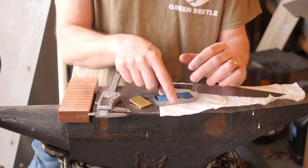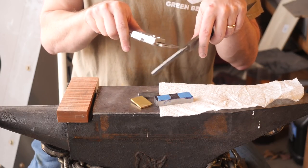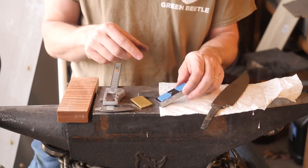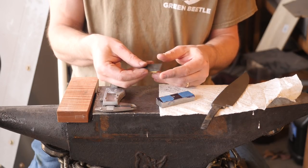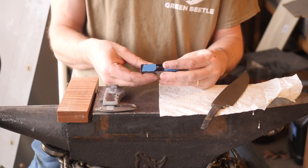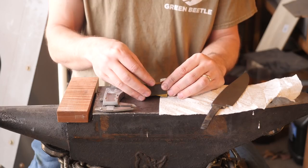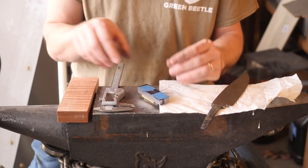I'm going to mill out just under 3/16, that's the width of my tang, and I'll file out or carefully mill out the rest. I do want sort of a semi-press fit with shoulders on there, so I don't want to overdo the milling. But I'm going to mill similar slots in the rest of the guard piece here, which is going to be sort of layered like that. Then we'll pin everything together with two pins on either side of the guard tang hole, to keep everything together while shaping and flattening goes on and stuff like that.